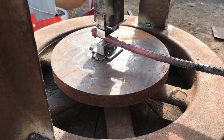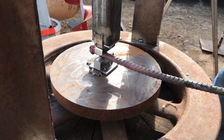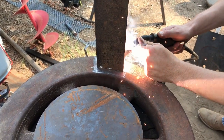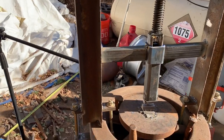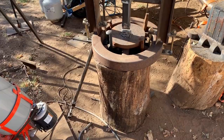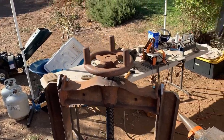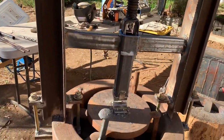You heard that pop — we just had this thing tacked together but we didn't put that much force on it. We didn't think it would be an issue, however this is cast iron and we didn't take that into consideration when welding. So we revamped the mounting — instead of just welding it straight to the base, we welded on tabs and bolted it entirely, so it is super strong now. We then mounted it to our stump and it looks awesome. The antique character really adds to the final product and the thing works great.